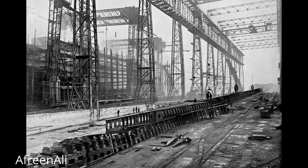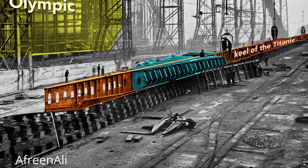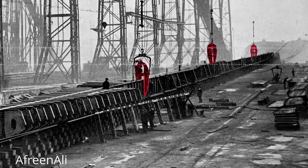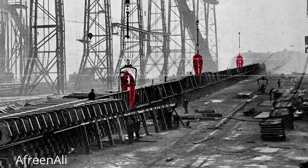So far we've watched the Olympic's construction. In the gantry, that ship sits here in the background. In the foreground lies the keel of its twin, the Titanic. Its construction began nine months after the Olympic. We see here, attached to the keel, the framework of the Titanic's double bottom. Notice this large claw-like mechanism lying on the ground, and these three hung from the cranes. These are hydraulic riveters which workers use to install most of the three million rivets on the Titanic.